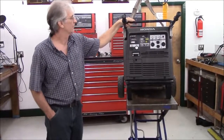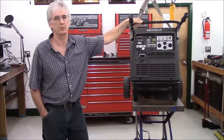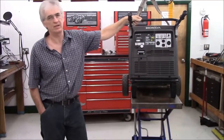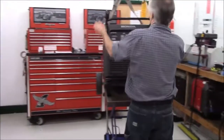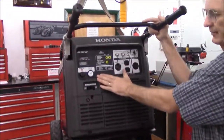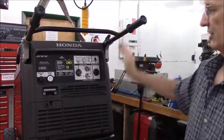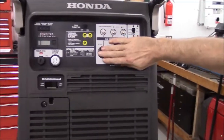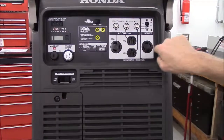This is the video installation instruction for the Pinellas Power Products 4-function wireless remote control for Honda's new fuel-injected EU7000iS. To start off with, there are at least 3 versions of the fuel-injected 7000iS that I'm aware of. There is this version, which I will refer to as the early US version, and you can identify it real quickly by the outlet pattern.